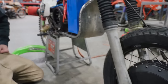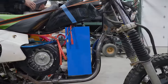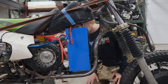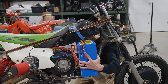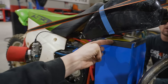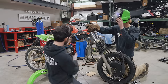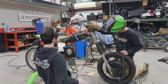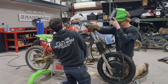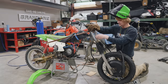Our task today is to come up with a safe battery hold-down to hold our 35-pound battery. That battery weighs just as much as the Tillotson sitting behind it. For battery hold-downs we're going to do it kind of like a car — some angle iron welded with a long bolt. I've got battery hold-downs mocked up. I'm just going to remove the battery so we don't have the biggest fireball I've ever seen in my life.